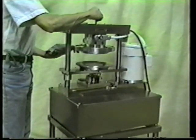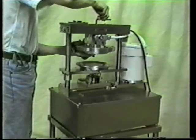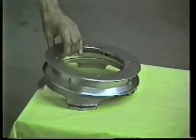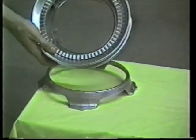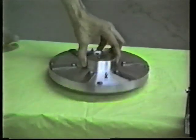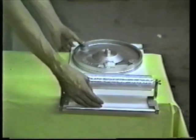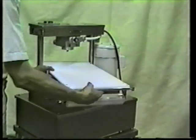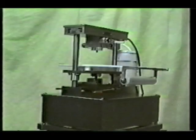In order to produce top crusts for double crust pies, we must first remove the bottom crust die set. Top crust forming equipment consists of 3 parts: the sealing tool set, the top crust forming die, and the top crust forming table. The top crust forming table is attached first. It is installed in the area that held the nest of the bottom crust die set.